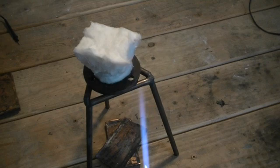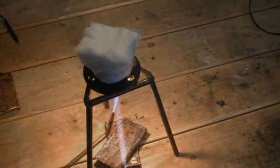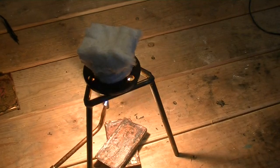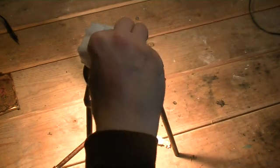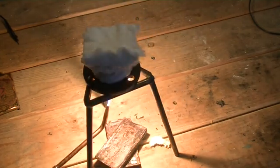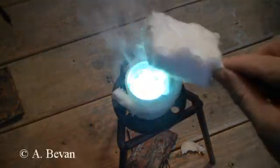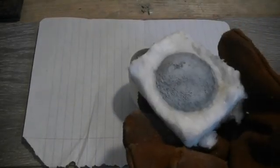With our powders mixed and placed in an alumina crucible, we heat the crucible using a gas torch. The exact temperature is unknown, but by the glow of the alumina it is definitely going to be above 1,000°C. With the gas torch turned off and the material cooling, if we briefly lift the lid of our alumina crucible, we can see a blue flame. This blue flame is characteristic of zinc oxidising in air — by lifting the lid we have introduced air and are re-oxidising the zinc metal we just reduced.